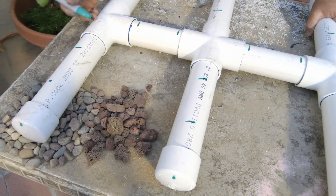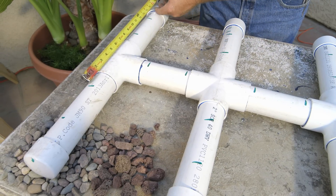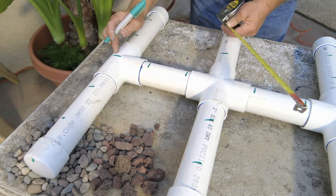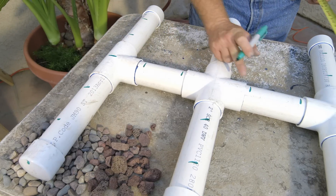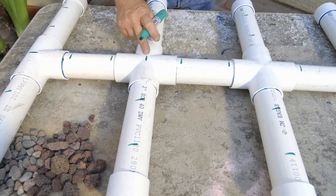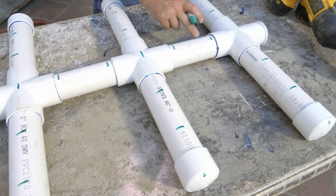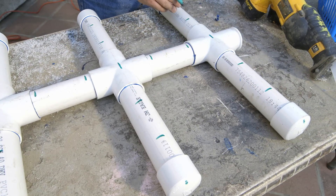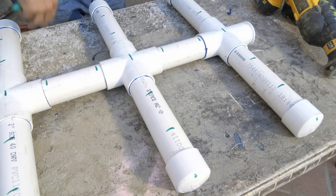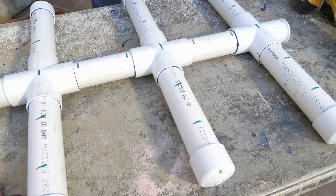Now in this section from here to here, I have about nine inches. I want a slot about every four inches. Since this is not a high pressure system — it's all low flow — I'm going to put a slot in the middle of my fitting here. As I work my way along, four inches, four inches — this area I have about seven inches. So I want at least every four inches to have a slot. I'm going to put a slot right here for water to come through, and add another slot right there, so I have water percolating up through every four inches. Those slots are going to be facing down when we put it inside the unit.